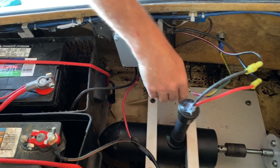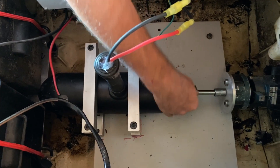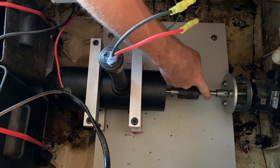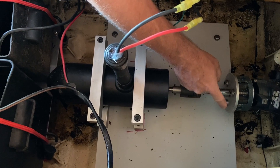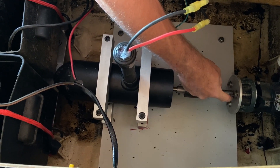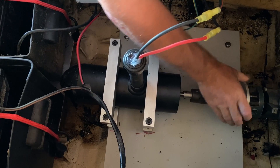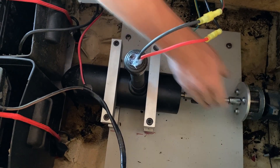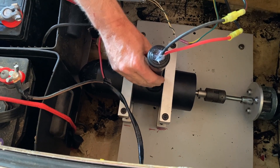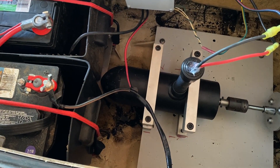If you look down here, you can see our drive unit. We've put a Lovejoy connection here and attached that to the motor. On the other end, I've taken a 3/8 drive extension and a 9/16 socket — on the inside of the socket is a hex — which runs the motor. It actually pulls and turns the output drive shaft of the Sea-Doo. To do this, we've had to make some clamps to hold the motor, plus a flat plate mounted to the existing motor mounts.